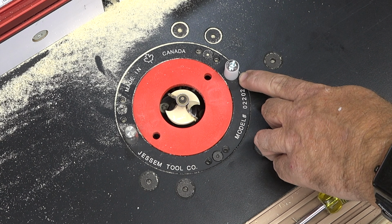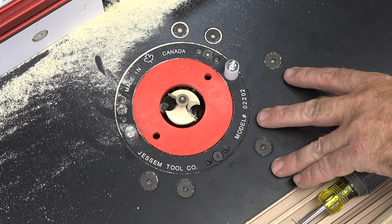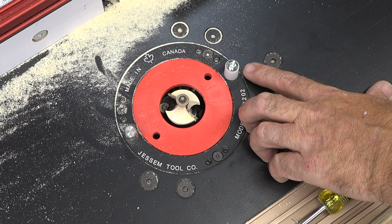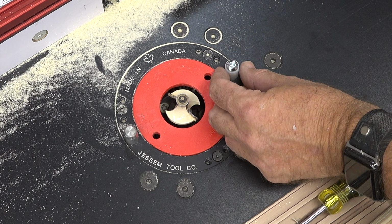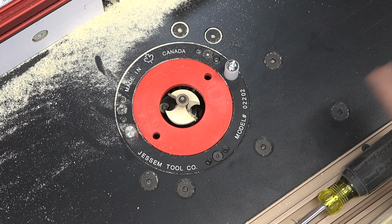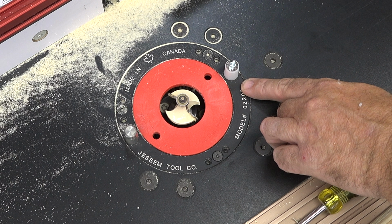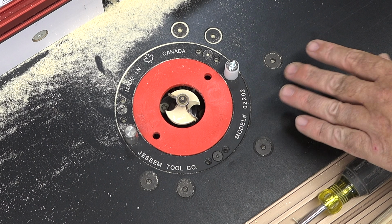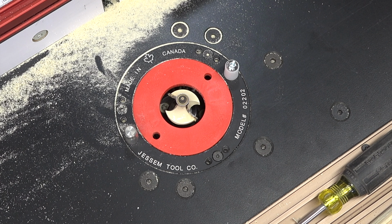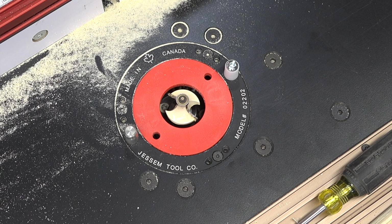If you have a 3D printer, print this whole thing, do it with 100% fill so that there's no gaps to make it more sturdy, with your 1/4 inch hole in the middle and your outer dimensions 3/4 of an inch long. It's a fast print. It takes no filament. I would do 100% fill so that it's a solid piece of ABS or whatever it is that you're using in your 3D printer. But there's no excuse not to have one, guys.